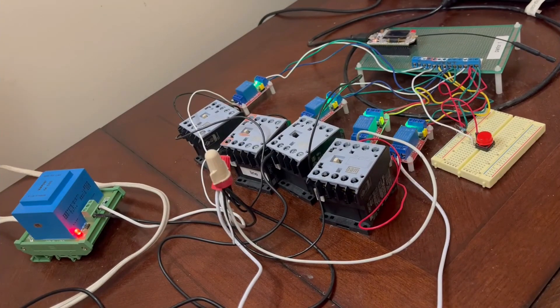Here you can see the ESP32 remote node that would normally be located in a dairy barn. It's on my desktop here with availability to a network. I'm using it to control the start, stop, and timing of the CIP cleaning processes, as well as monitoring the chemical temperatures and levels of the tanks. I have four interposing 10-amp relays connected to this ESP32. On the secondary side of these relays, I'm latching coils on these contactors. These could be starters or digital signals to variable frequency drives or soft starts to control the tank pumps.